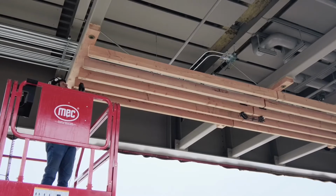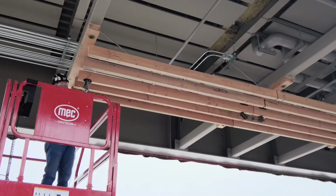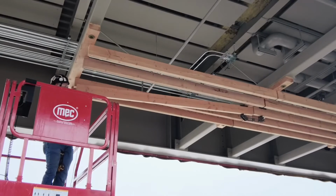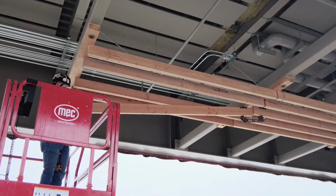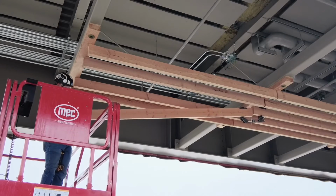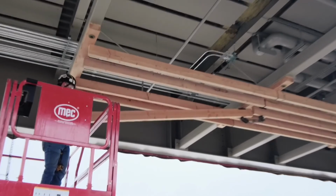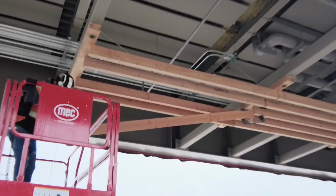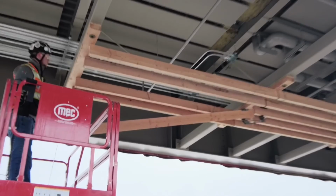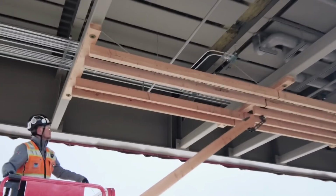It's a good thing you don't have to back the screw out all the way. Right. Just get it out of the beam. So all of the fasteners that go in day one have at least 3 inches of embedment into the beam. If it's backed out some yet to be determined number of times, you can just go with a longer screw. I think the typical screw now is about 8 5/8, and then I think they go up in 1-inch increments.